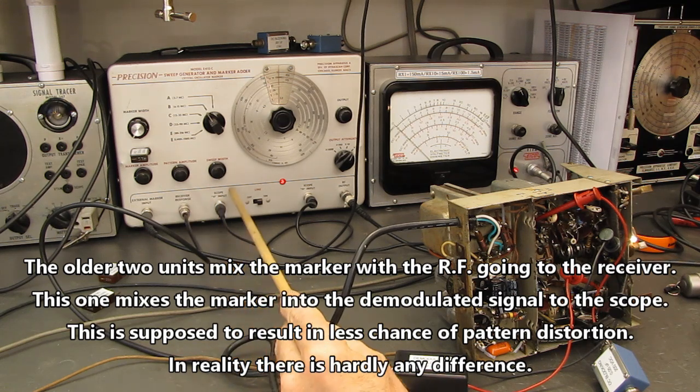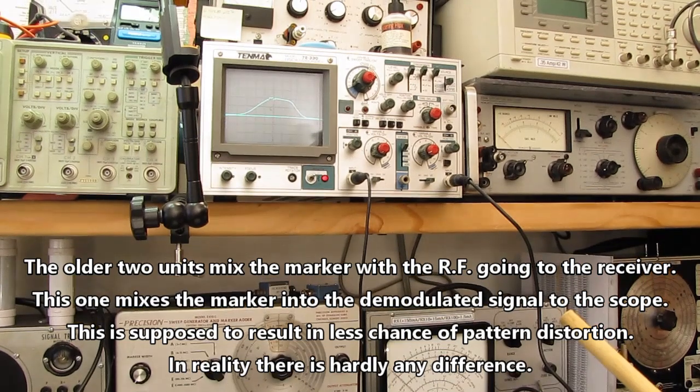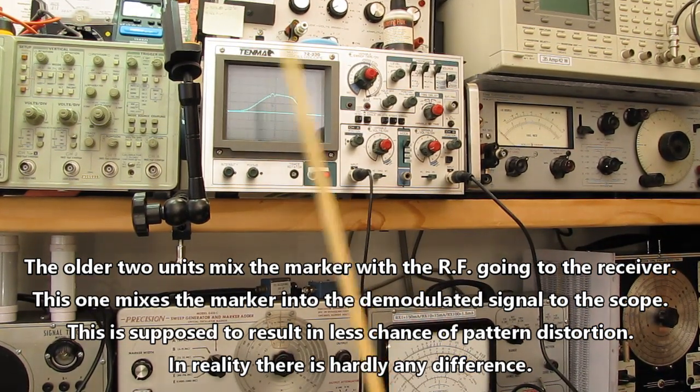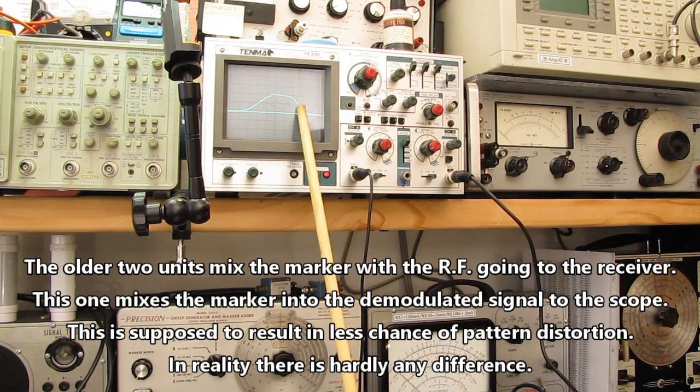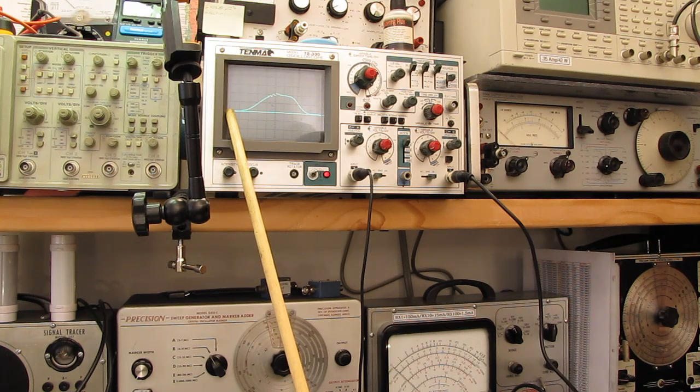We have coming back out the scope vertical input. This goes to the vertical input on the oscilloscope up above here. Can we see that? There's a lot of reflection. We'll move the camera here shortly. This gives us the vertical part of the deflection. The straight line you see here is the retrace.